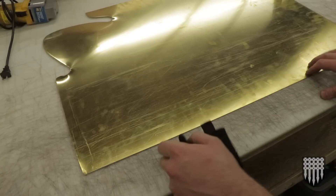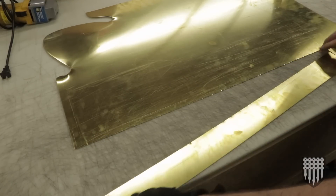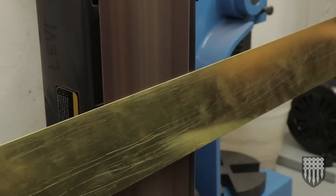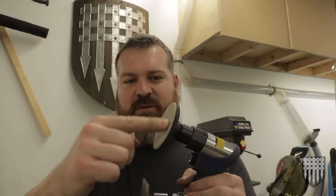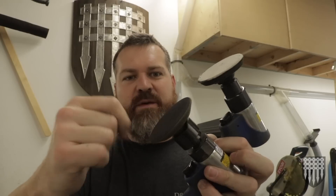I have this cutting glove that I like to use for cutting — let me just show you how it works. Down in the description below you'll find links to almost all of the tools I use in this video, but unfortunately this cutting glove was custom made a couple of years ago and it is not for sale anywhere I can find online. I also grabbed a little three inch mini polisher — just a regular straight roundy round — and a little three inch orbital. It's got this chuck where the pad spins non-concentric, so it doesn't leave a swirly pattern on the material. I'm going to zip over and give these brass pieces a quick brush-up with 320 grit and then 600 grit — it's going to take just a few seconds.